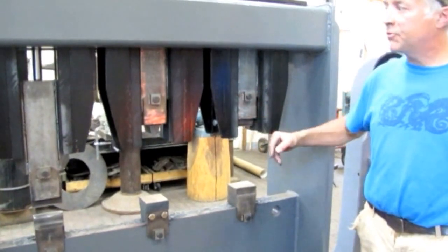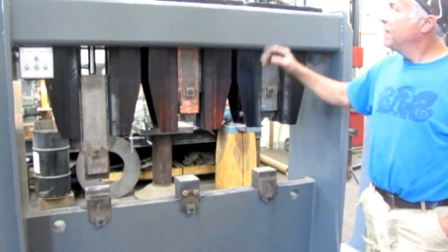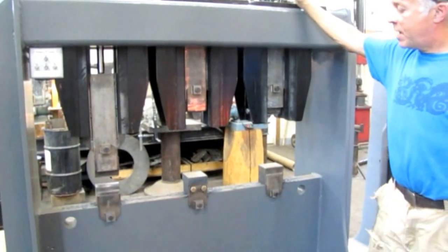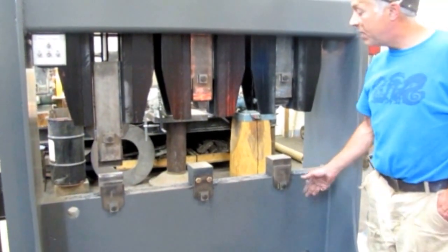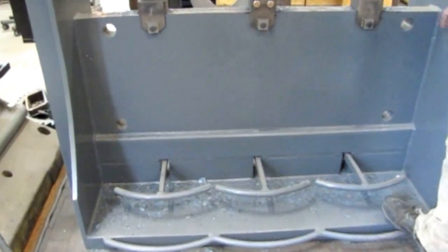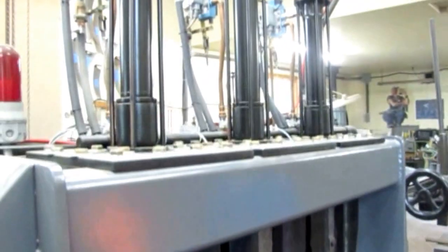This is the third generation of a whole long series of power hammers I've been making, and it uses plastic guides, two-and-a-half-inch air cylinders, and a single, very heavy plate that at one angle is able to be useful to three hammers on a smaller footprint. I've got separate control for each one. The valves are electrically controlled, except the throttle valve is mechanically controlled. We'll look at the valves shortly.